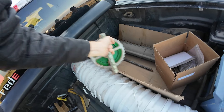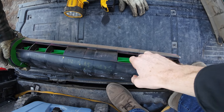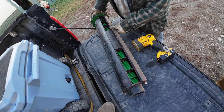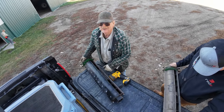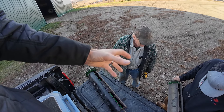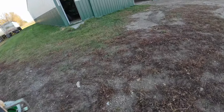Grab one here. This one came apart really nice. We were able to reuse the shaft that was already in there. We did reuse your tuning rings here. This looks very good. That should give you a consistent drop — your product should flow consistently through your airstream instead of what's called an intermittent drop, where it might dump some and then stop.